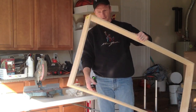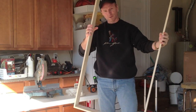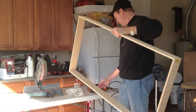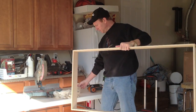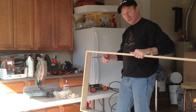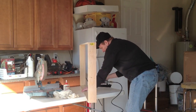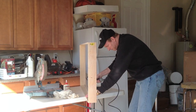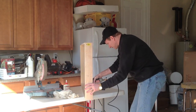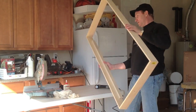Step one: I'm going to use a little bit of glue just to make it more sturdy, then glue the top of the frame. The box is done — stapled in, sturdy, looks good. Now I'm going to put the cleats in. With the cleats I'm using inch-and-a-half staples, shooting them in a little sideways so they don't go all the way through. I just flush the edge at the inside of the frame and shoot the staples in — that's it.